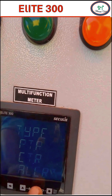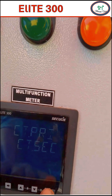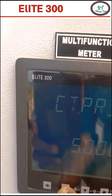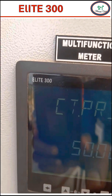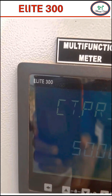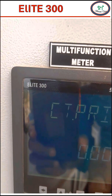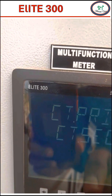The third menu is CTR — it is the CT ratio. My system is 60/5 amp CT ratio, so I have to set 60 amps for the primary. If you want to change the decimal point, you should not press enter first. First press the up or down arrow to where you need to change the decimal point. Once you fix the decimal point, then press enter and you can change the value. Press up to increase the value, press down to decrease. The blinking position indicates which digit is being changed. After changing, press enter to save the value.